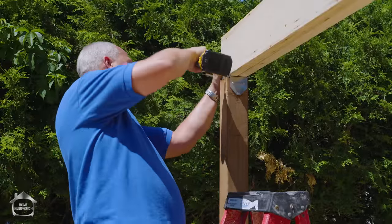Keeping the total height under eight feet makes all your building materials work with one seam — it's still much easier. Resist the temptation to make your shed 10 feet tall — it really is a waste of time and money. I'm going to go do the other beam now; you don't need to see that one, same thing, just a little closer to the ground. We are creating a single slope roof after all.